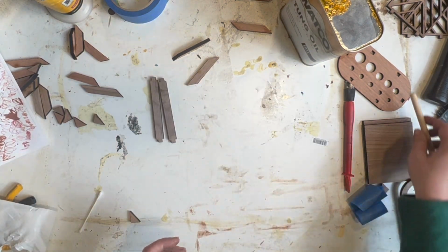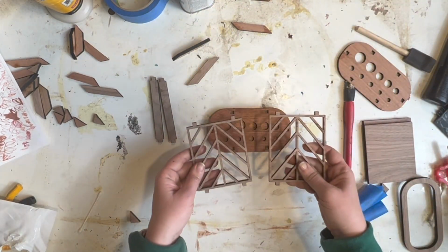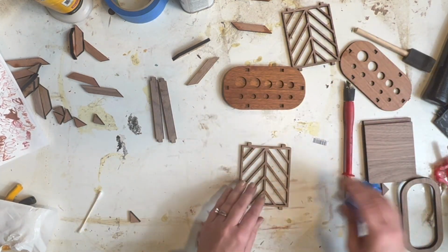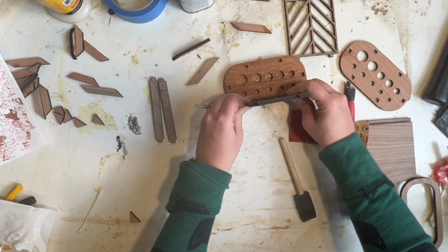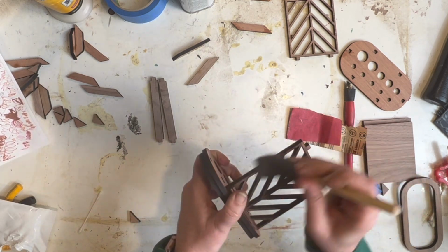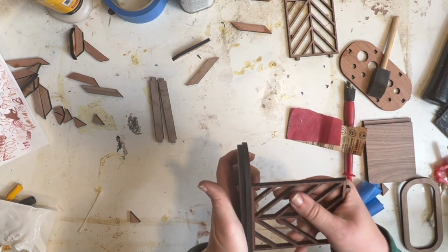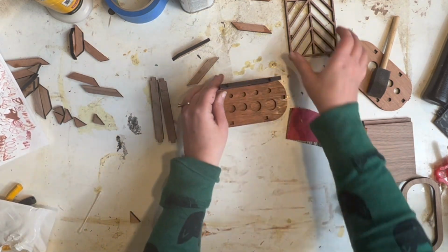The other option, now that we've already glued it, is we could just put these in totally open, okay? We don't even have to glue anything. So we would want to go ahead and clean up the back, oil it, place it right down. Now again, I mixed my woods. So what I did was I measured my walnut for how thick it should be, and that's the size slots I used on my Sapele. All right, I know that's a little bit more advanced.